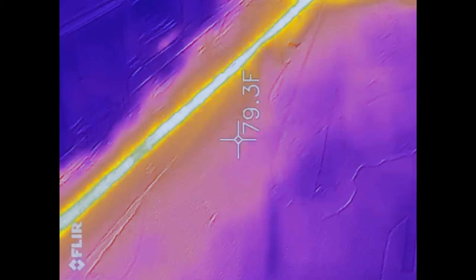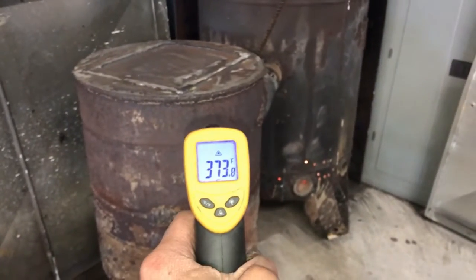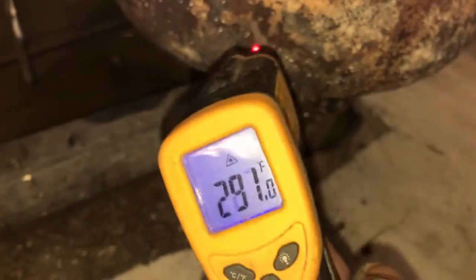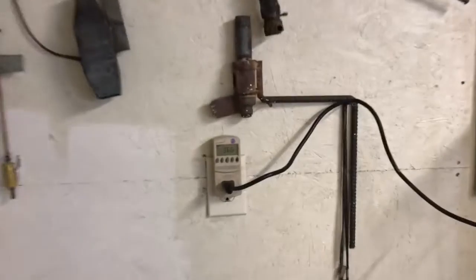I'm definitely glad that I went ahead and did that — that's just recycled fence post. Look at the smoke — it stops smoking after it's been running for a while. It burns the smoke inside the throat of the reclaimer intake. So we just started up; it takes a minute to get heated up. Look what happens to the flames as they're shooting down that intake — the smoke has a hard time making it out of there without being burnt. Because we're choking and bottlenecking down the exhaust, we're kind of forcing it into a scenario where it has to be burnt. The smoke's probably already dropped off a little bit — not too much stratification. I think this thing's going to be just fine; the FLIR image showed it was going to be alright.